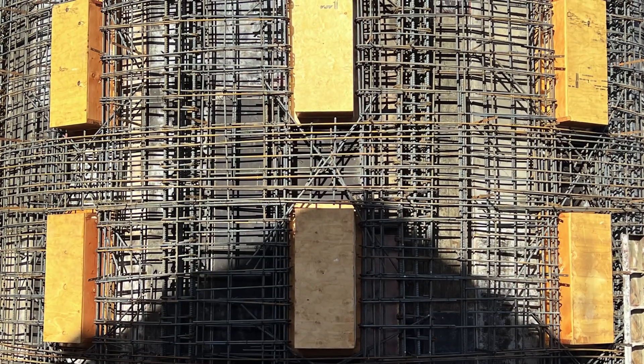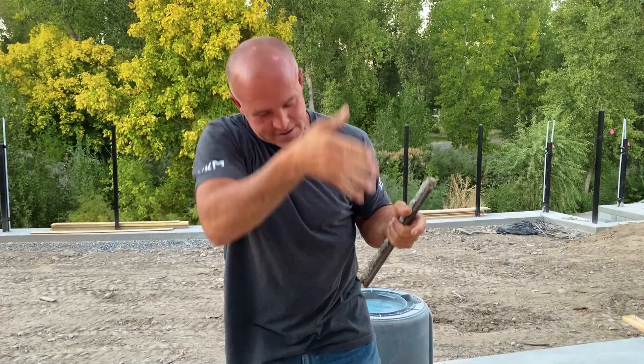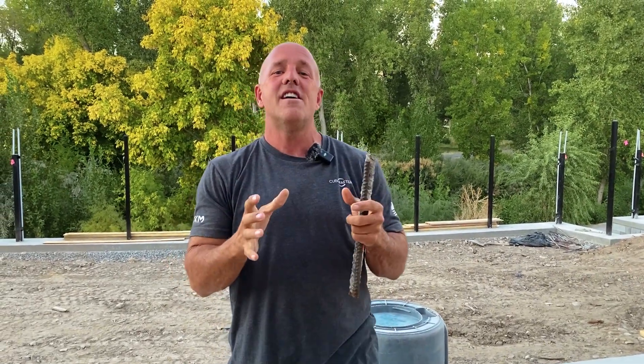Some of the fun things about doing this pool — specifically to get windows in it — we had to do something unique. When you're doing a cylinder it's one of the strongest structures you can build, which adds advantages and simplified it, but what made it more difficult was putting elongated windows in it. I could have gone the easy route with small windows, but I wanted kids to be able to walk up from the outside and look up and also look down 14 feet below them, so I wanted long windows. What that does is it creates an area where the pool would want to billow outward — it sounds funny even with that much concrete — and bow outward, causing stress cracks right off the corners of the window.